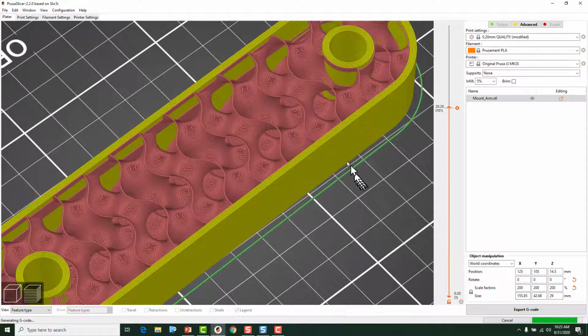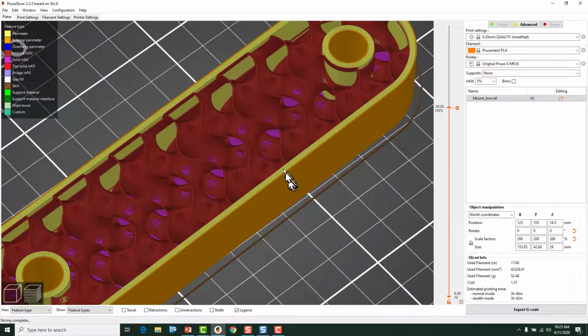And compared to the part we had before, you see these much thicker outer layers now. And this part is loaded here and here with a bending moment. So I've got a load pulling down here, and then this guy would be fixed. So the bulk of the load is going to be taken on this surface and this surface. Now, you guys haven't taken solids and materials and stuff, but whenever you're doing any type of part loading, the maximum happens at these outside edges. One will be in compression, one will be in tension, and the maximum is as far away as you can get, which is the outside edge of the part, which is why this method works.